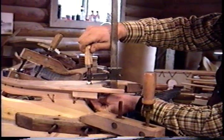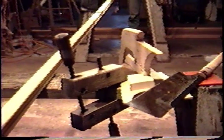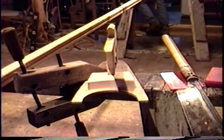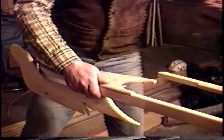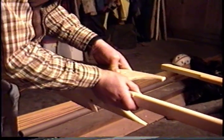Angles of these dowels are for structure, and this is the section cut out for the bow plate to fit in. This is our bow plate. This is the stern piece that has been lashed together — it will be pegged down the center in a minute. We're going to attach the bow piece onto these panels, clamp them up loosely, and then peg them and do some lashings on them.